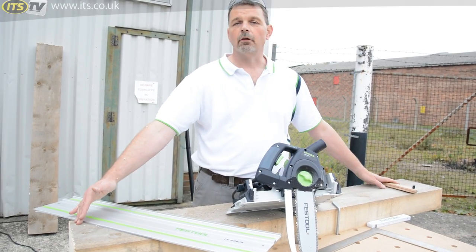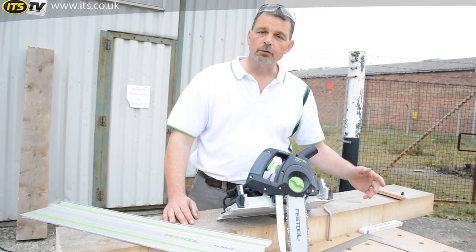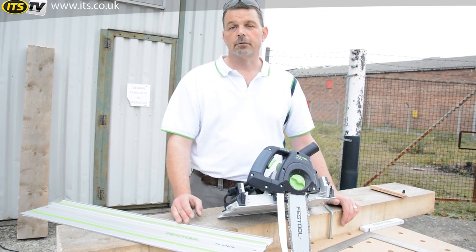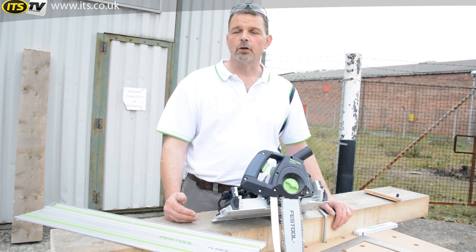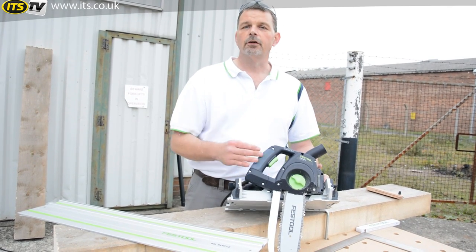What I've got here is an example of a common rafter. It's all set out — our pitch angle is 38 degrees, and again this was done with a roofing square. But trying to cut this timber, I've got some choices. Could use a hand saw but it's going to take a long time. A plunge cut saw isn't really practical, especially when it comes to a bird's mouth, so my next best option is something along the lines of the sword saw.